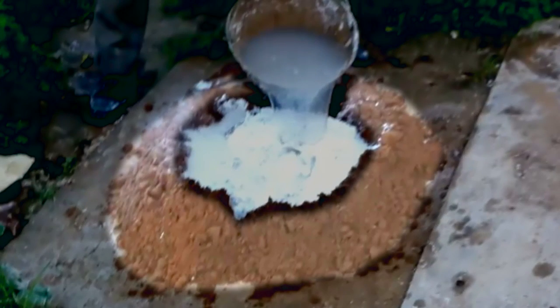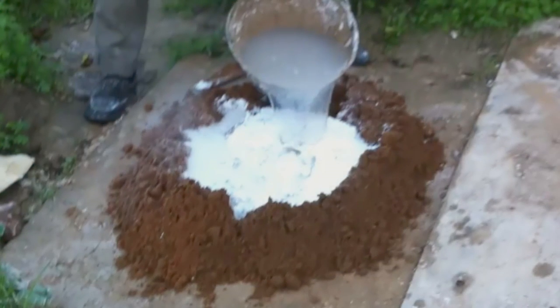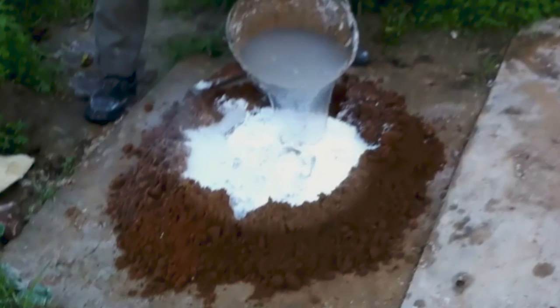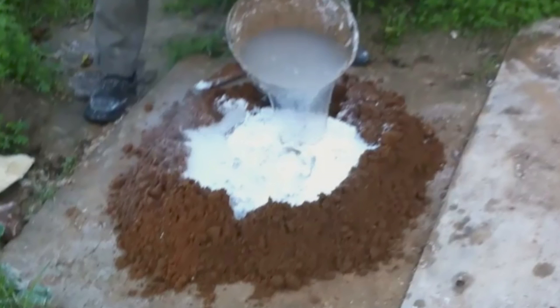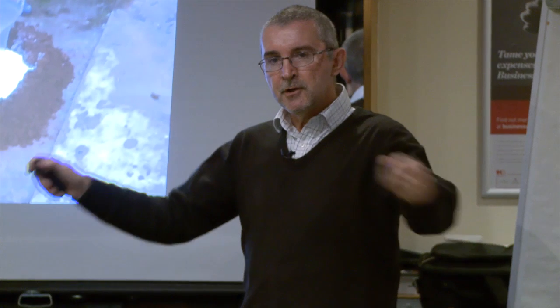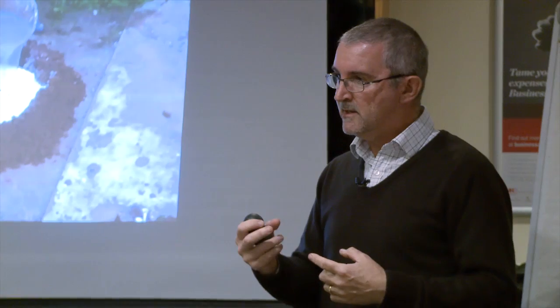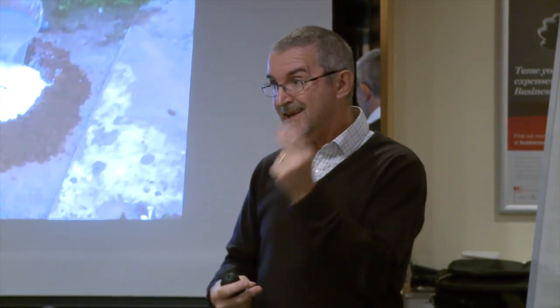So around the perimeter here, you've got your sand, and in the middle not your mortar, your lime, your quicklime, effectively unslaked lime, this white powder, and then you add your water to it. Immediately you add your water, you mix it in, and if you've got 2 or 3 people doing that with the shovel, the better it is, because that exothermic reaction, which I showed you on that little video, really starts kicking in instantly.